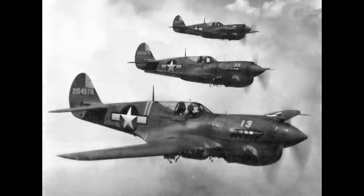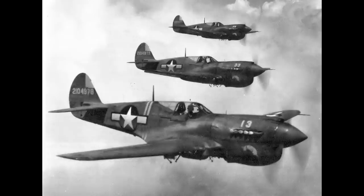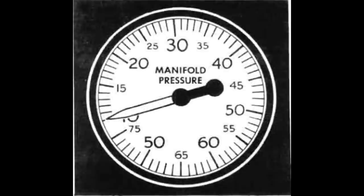We're going to start off here by looking at the American P-40 Warhawk's Allison engine and supercharger. Like just about all WWII fighters, the P-40 has a supercharger to boost the engine's power and to help it sustain this power in the thinner air at high altitudes. Without a supercharger, the Allison engine would have a maximum manifold pressure of about 30 inches of mercury. With all other factors equal, more manifold pressure equals more power, and the supercharger is capable of delivering the engine's maximum allowable manifold pressure of 52 inches.